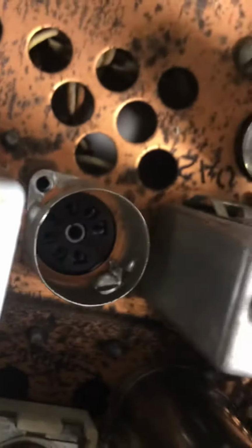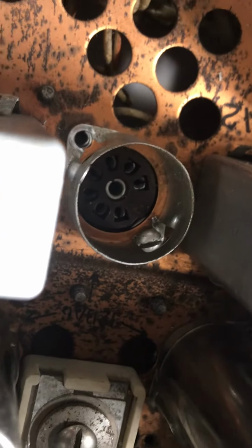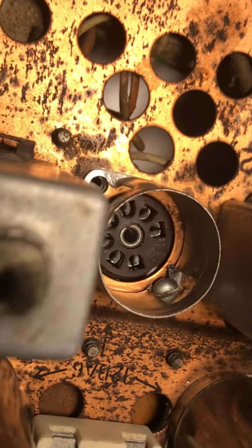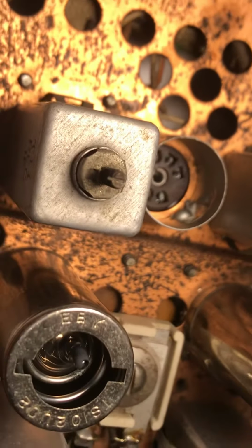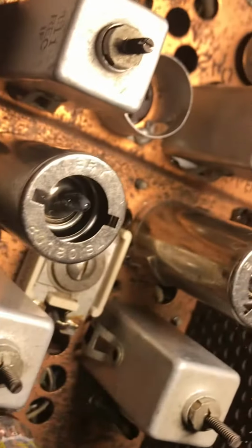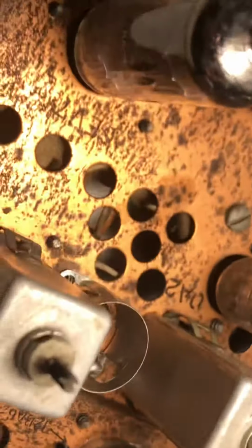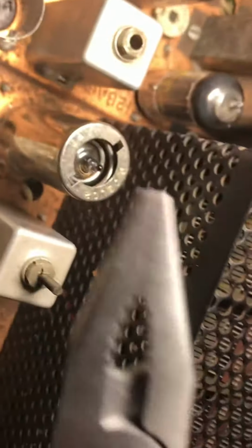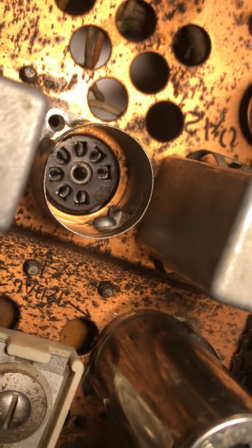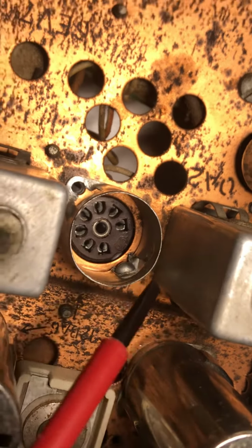So over here on these IF tubes on the TR4, I've taken the shield and I've kind of used metal fatigue and some pliers. In fact, I used these pliers here, which worked very well. I just grabbed that shield and roughed out the metal with the pliers by using metal fatigue, and so that turned out pretty well. Didn't have to grind. So now you can see this shield here, there's nothing really blocking the tube.